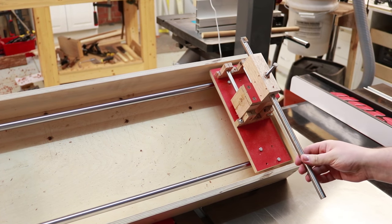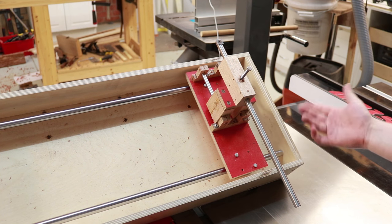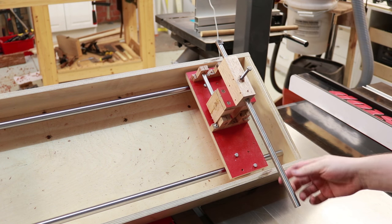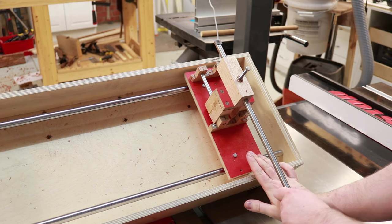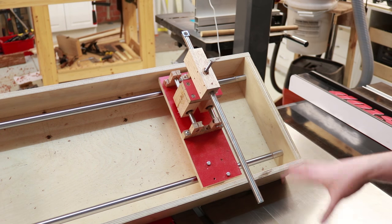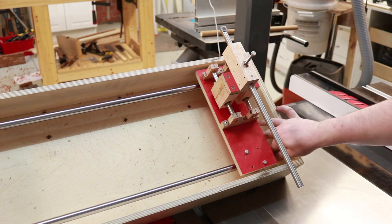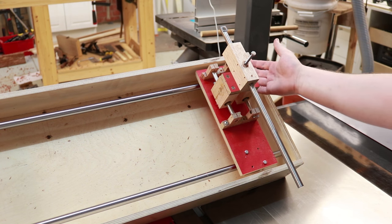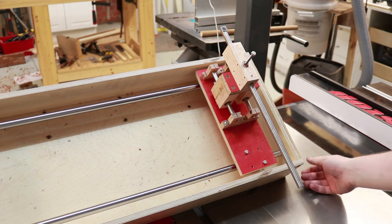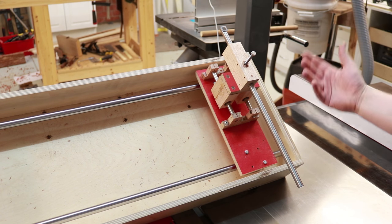If you didn't quite catch it, this goes in and out at the lathe. It's got a carbide-tipped cutter that I made. It goes left and right, back and forth. The limiter here means if I undo that I can adjust how far forward it goes. If I hook that up to a template or a pin and a template, you could follow the curves of a template fixed across there. Originally my intention was that I wouldn't need a toolrest, hoping the two shafts would be stiff enough — but they're not. So there isn't a lot of point having two shafts if you need to use a toolrest, because you just have the one shaft and lean it on the toolrest to cut. That's likely how I'll redesign it — get rid of one of the shafts so it's easier to mount on the lathe and takes up a bit less space. I'll redesign the carriage as well.